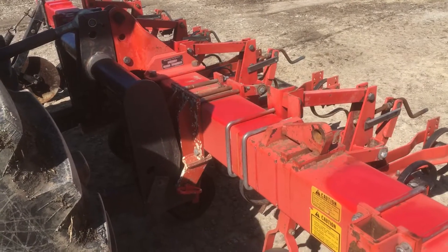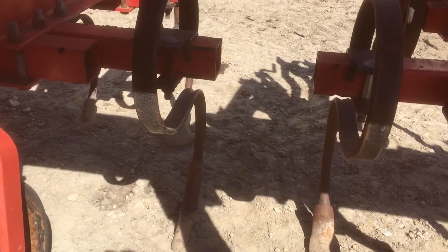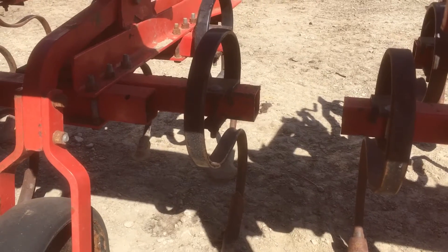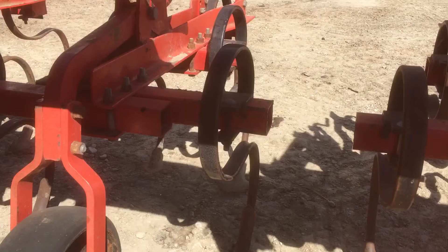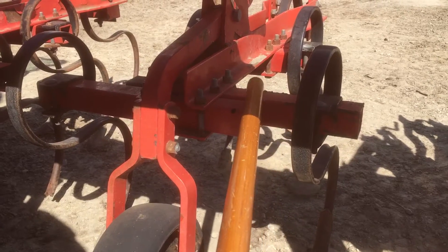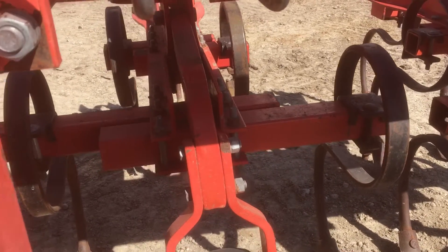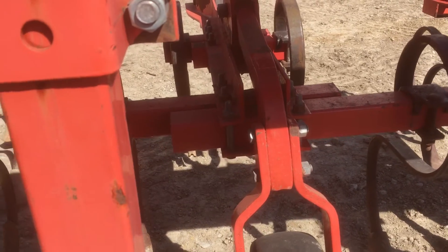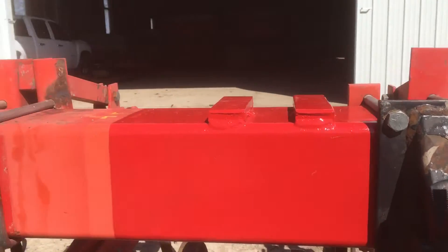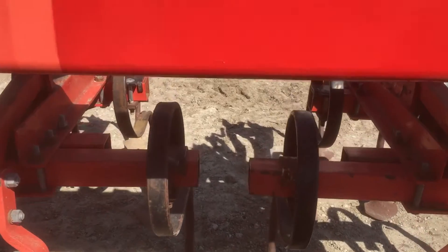In talking with Darryl Henderman, he gave me the idea to use the little bitty spike tooth. So we were able to get this eight-row wide cultivator, and what it gave us was these pieces of stock that are longer — they reach out farther than a 30-inch row because they had to reach wider for 38-inch rows. We cut the wings off the cultivator, welded it back to a solid rigid toolbar, and we've got our six rows set up now. We are going to work on implementing Darryl's idea.